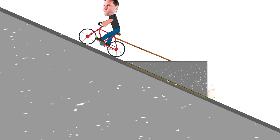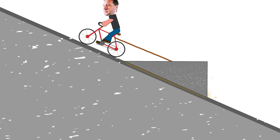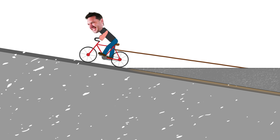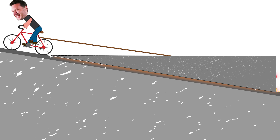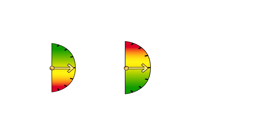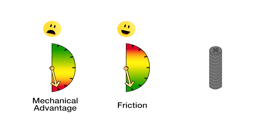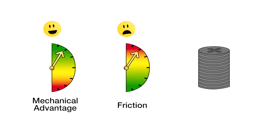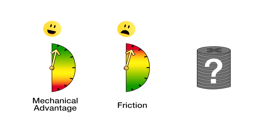This demonstrates the efficiency of mechanical advantage — the small angle results in an easier turn. Now let's add friction to the equation. Friction comes from how much surface area the screw's threaded spindle is in contact with the nut, so there will be less friction on the small diameter screw and more on the large diameter. Ultimately it's a test of mechanical advantage versus friction. The small screw will have less mechanical advantage but less friction, and the large screw will have more mechanical advantage but more friction. What will output more force?